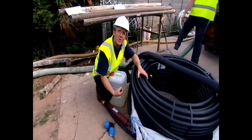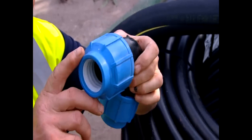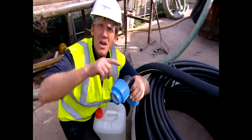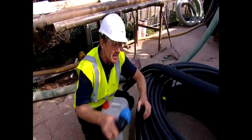The water and glycol is pumped down into the pipe, grabs the heat, and then away. A metre below the ground they terminate the pipe, cut it off there, and then change it to a couple of elbows. That pipe can then go in — it's a thinner-walled pipe because it hasn't got so much pressure — and that will then go directly into the heat pump.